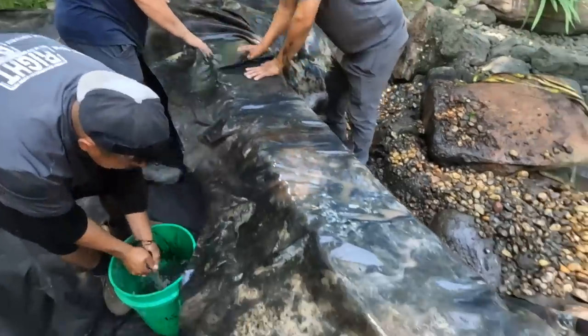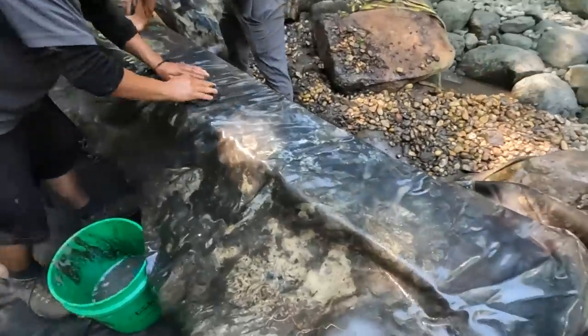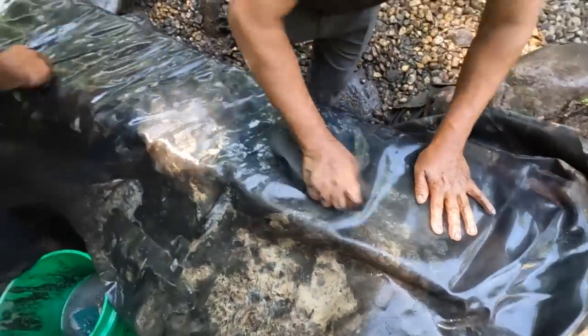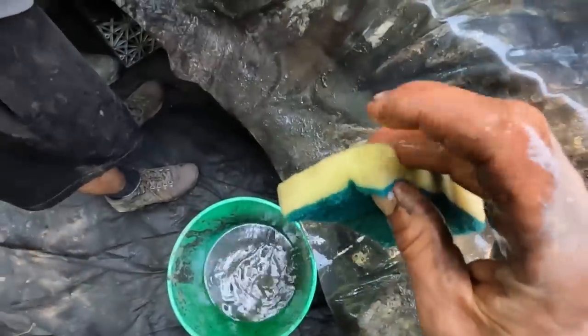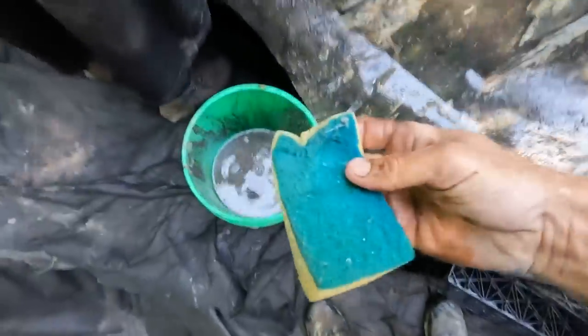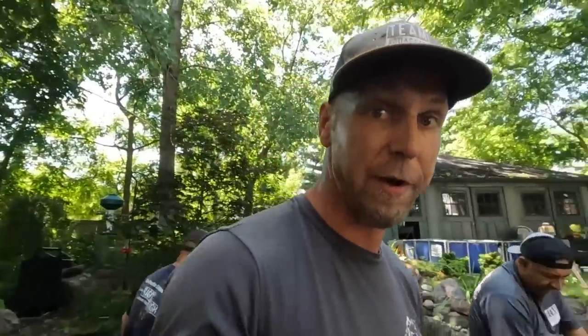We're starting to seam the two pieces of the liner together. That's one of the biggest challenges when adding to an existing water feature without tearing everything apart and coming with an entirely new single piece of liner. Juan, Luis, and Zach are over here scrubbing, trying to get all that scale, buildup, mud, and residue off. One thing that we have found to really help are these Scotch-Brite pads — normally the ones without the sponge on the other side. They really take off a lot of that stuff and scour the liner without hurting it at all. I would recommend using these over those wire bristle ones any day of the week, because those can pierce the liner and little pinholes would be very difficult to find.